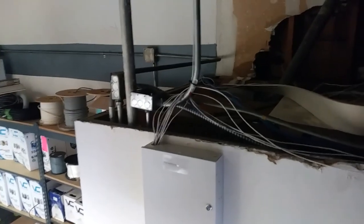That's also where our 40 amp comes in for the condenser, our 40 amp circuit that's laying there. We're gonna transfer that to EMT down below here and then run that up for the disconnect, and then we'll run from this J-box directly to the air handler. I saved the switch that was on there, so we'll use that as our air handler disconnect. And that'll be that.